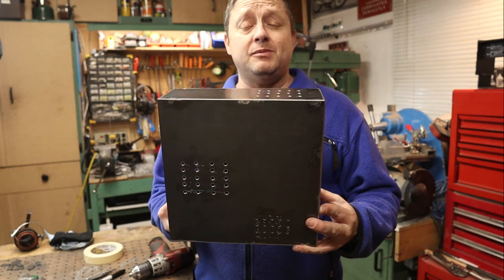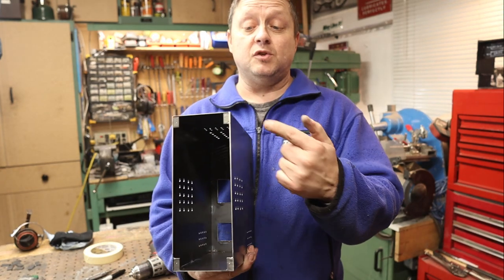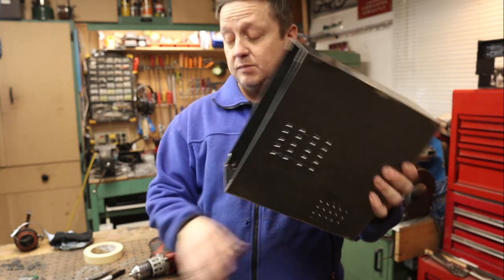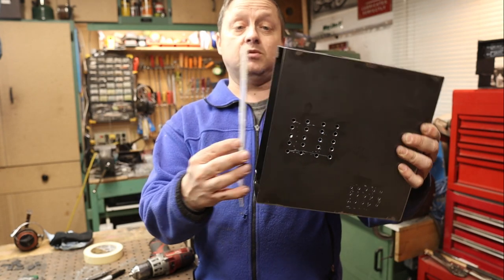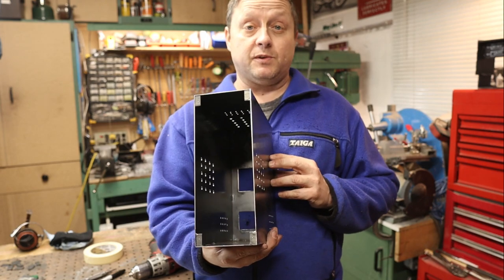The carcass is pretty much complete. We still need to do some paint and primer but we'll save that to the end. The next step is to locate the thumbscrew locations that will retain the amplifier inside this box. Here's the faceplate - basically we'll do it like that, drill and tap the mounting holes, and then we'll make some thumbscrews for it.